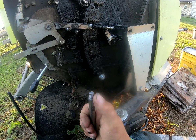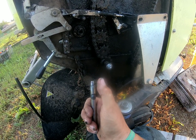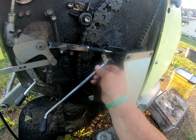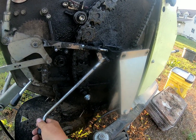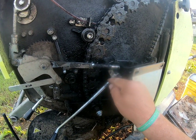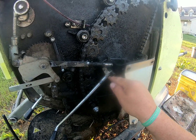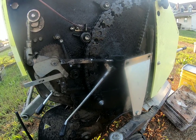What I done is I put that bolt in there, drilled a hole right here and welded a bead in there to fuse that bolt to this tube. That'll strengthen that tube where I'm going to have to be welding. Because that lightweight tube — I think that's part of the issue: they welded this and kind of weakened that tubing right there and eventually it broke. So now there's a little gap there I can weld in, and I'll be welding to that bolt in there and fusing this all together whenever I get it to the welder. But temporarily I'm going to drill a hole through there, right through that bolt, and put a cotter key in there to hold it in place. It should work for now.